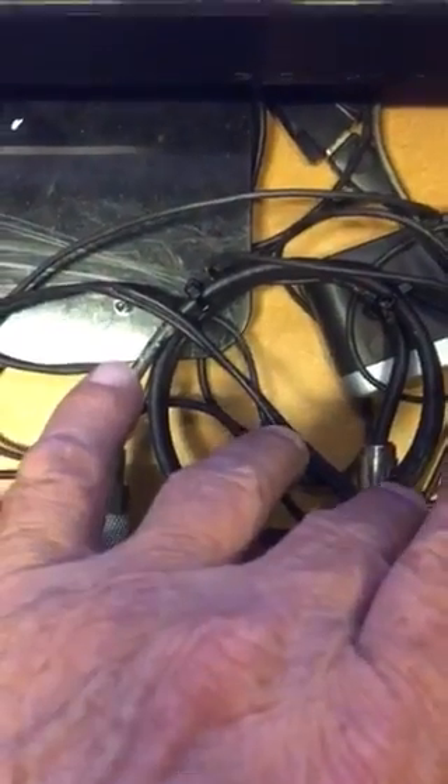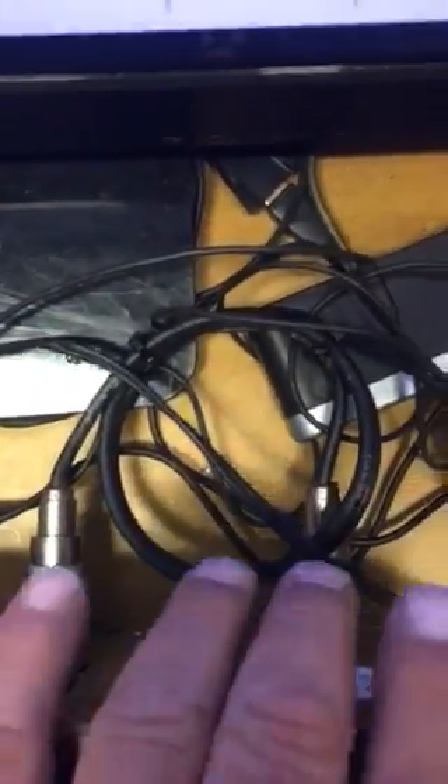On the back you can see three SO-239 connectors. This one right here is a jumper - basically the stock radio output is right here, and if you want to plug your antenna in it you simply run stock and it does not go through the amplifier. If you jump the stock output to the input of the amplifier, that then makes this the output and it runs through the amplifier and out.